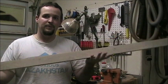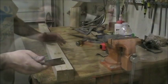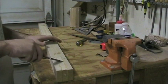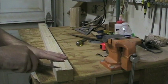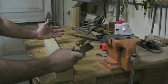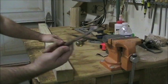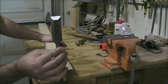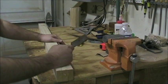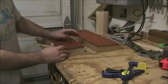What we're going to do now is trim off the excess glue before we take it over to the planer. Get yourself a chisel and with the bevel side down, go ahead and get all the big pieces of glue squeeze-out. I like to do this before sending the piece through the planer — it probably doesn't really make any difference, but I think it's easier to resharpen a chisel than to put new planer blades on. So I'm going to take off the vast majority of the glue on both sides, and then we should be ready for the planer. It's already gone through the planer now, nice and easy, looks nice and flat.